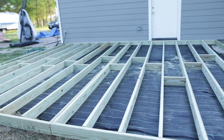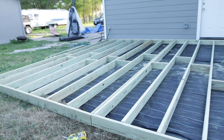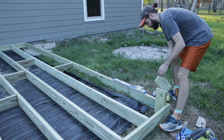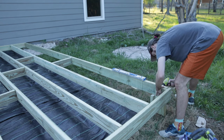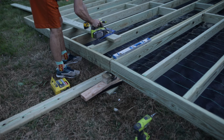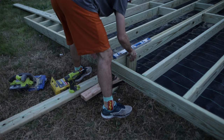Skipping ahead a little bit — I put some joists in between the other joists to sturdy out the deck. Now I'm putting legs on it. I saw Home Renovision do this and suggest it. Instead of putting feet into the ground and cementing — because I might have to move it at some point — I decided to do it this way. It was pretty easy to level out: cut little pieces of two-by-sixes and put feet everywhere.